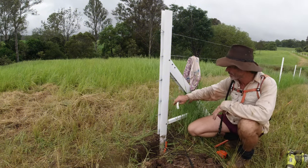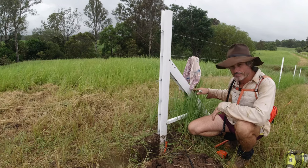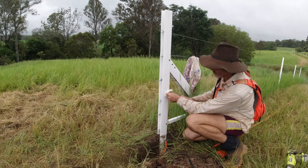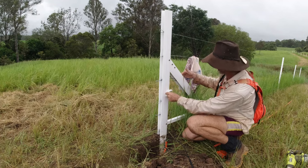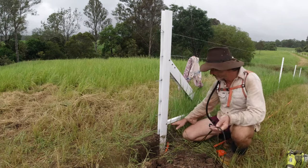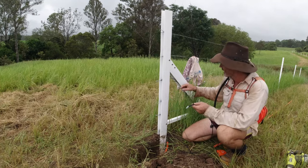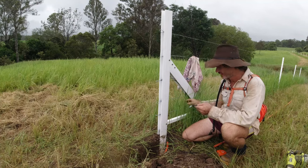The next thing is to continue the pipe upward to just above that third wire. I've got it that high because grass grows up against this fence, and at that height you can drive around and see if there are any issues. It also gives me room to bring the wires down and join them here using the H-posts. I've got two wires because the bottom one — 16 inches off the ground — is going to be used as an earth. So one jumper wire goes to the earth wire, the other to the live wire, and then I'll just jump each of the other five wires together.